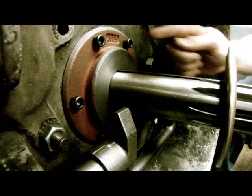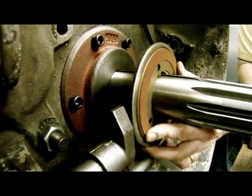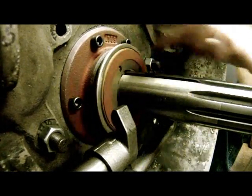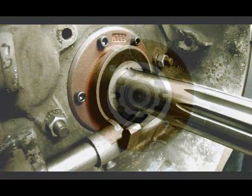When installing a brake, make sure that the transmission bearing cap is flat and free of heavy burrs or marks that could cause uneven wear. The torque-limiting brake will need to be slid on the input shaft while the transmission is removed. The same goes for the one-piece brake or the two-piece hinge brake during the clutch installation.